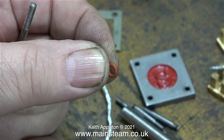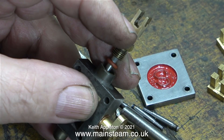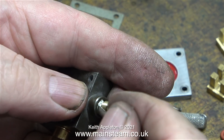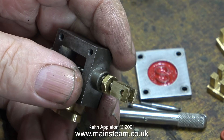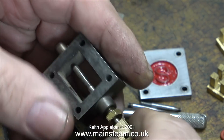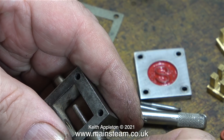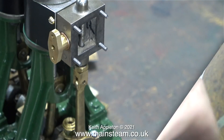I'm going to take advantage of having the engine in pieces in my hand to fit an o-ring first. This is a bit over the top really — the o-ring isn't required, it's not essential. The teflon coated yarn would have been perfectly fine by itself, but for the video I just wanted to show the options. As always when packing stuff in glands, I tightened the nut then backed off the gland nut to release the pressure. If you apply too much pressure to the gland packing, a lot of friction is generated on the shaft. So once you tighten the gland nut, back it off a little bit and have a feel for how much friction is on the shaft.